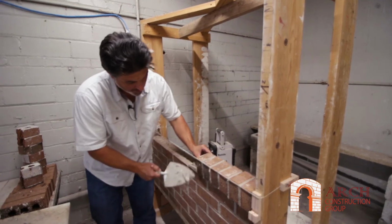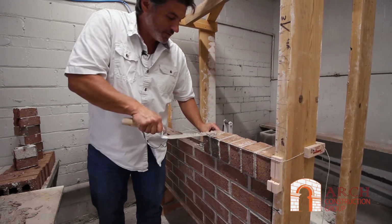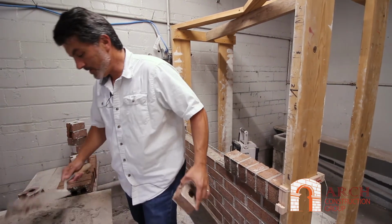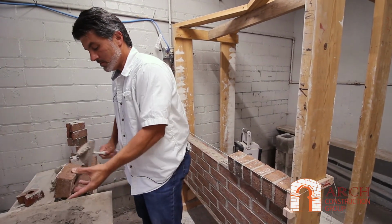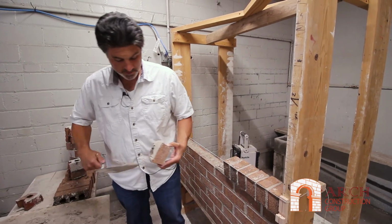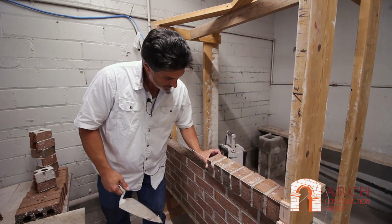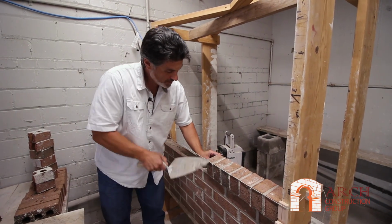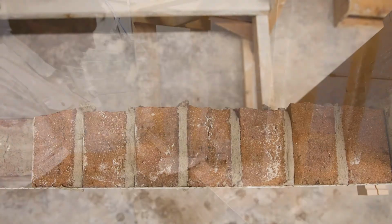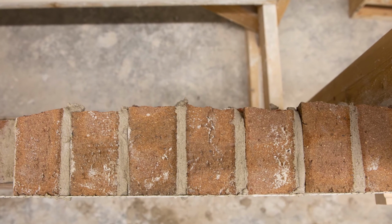Always cut your mud away. You don't want to smear this up, especially if you're on the second, third floor. You're going to see the underside of that sill. So be meticulous with your movements. See, I put a little extra dab on there. Always hit the back. You can see the difference right here. That extra move of swiping the back, and then when you don't do it.